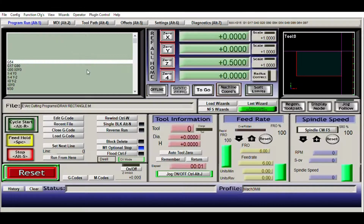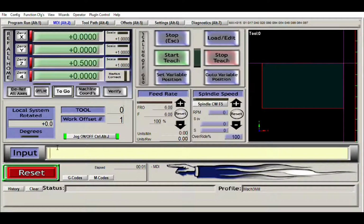To cut an arc to size, we need to take into account the diameter of the cutting tool we will be using to calculate the cutter compensation for each of our coordinates. CNC programs will do this automatically if we use a G41 or G42 cutter compensation instruction in our G-code.